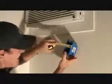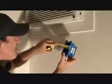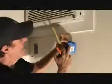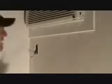Now I can measure this box, and it's almost 2 1/4 inches. It's in between a 2 1/4 and 2 3/16. And I'm going to measure this, and I've got to make sure I got it in the right place, because these tabs on the cut-in box fit over the top of the sheetrock. It fits a little bit different than this box off here, that existing box. We'll talk about that one in a minute. So I got to measure this, 3 5/8.